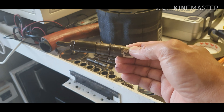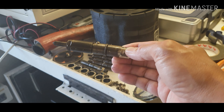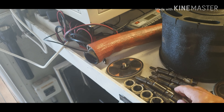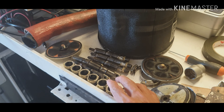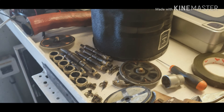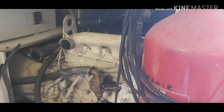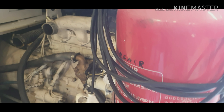We've already removed the injectors. This is the injector for the generator. The model of my unit is Onan — one 40 kilowatt and one 20 kilowatt. We've taken out the injectors and I'm going to bring them to the shop for calibration. We removed six injectors total — one, two, three, four, five, six — this is just for the one generator.